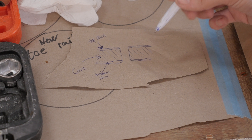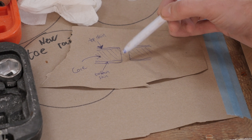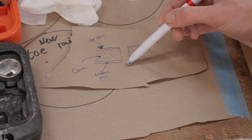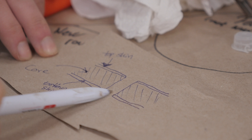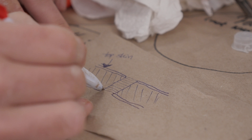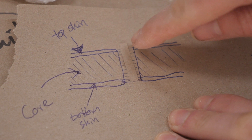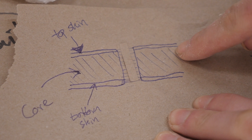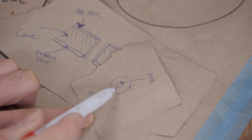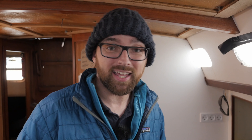Let me do a quick drawing to help explain. This is a cross-section of one of the supporting frames for the hatches. Here we've got the core material — in this case plywood and mahogany — with the top skin up here and the bottom skin down there. I've drilled a nice big hole through it. The next step is to fill this hole with thickened epoxy, leaving me with a hole through the sandwich construction that is completely sealed off from the core. Seen from the top, there's a big blob of epoxy with a hole in the middle of it that does not come in contact with the core in any way. This well-known method is called drill, fill, drill.